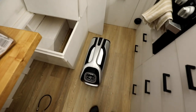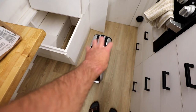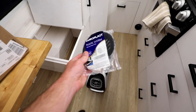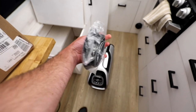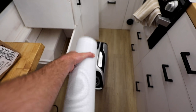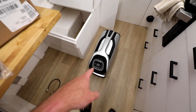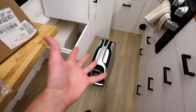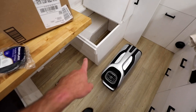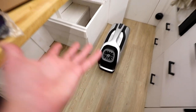That's part one of the install process - dealing with the intake and exhaust for the compressor and cooling unit in the back, going out the sidewall. I have some plastic vent grates with bug screens, and that's what it'll look like on the outside. Now for the cold air delivery from the front - if you remember your physics, cold air sinks relative to hot air. It would not be ideal for the cold air to just pour out the front of the seat and pool down at the bottom of the bus, so I need to get it up higher.